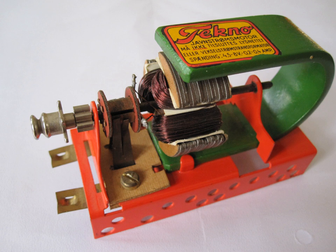The coils were thus long and shallow, sometimes of only a single layer of wire, which required a long core simply to contain their size. Single small coils could be mounted horizontally, but the most common arrangement used two tall coils side by side. To improve the efficiency of the magnetic circuit, it was realized that multiple magnetic paths could be provided through the same armature.